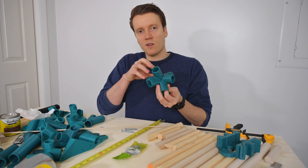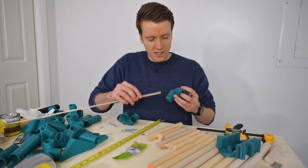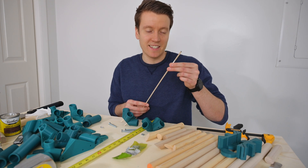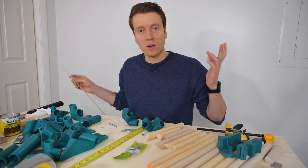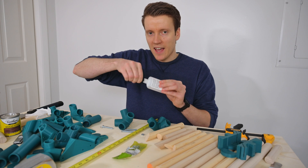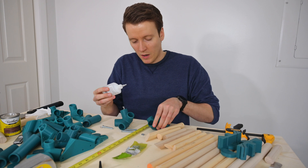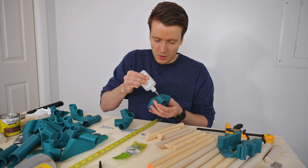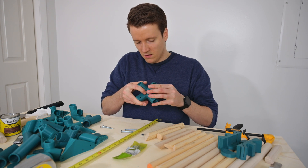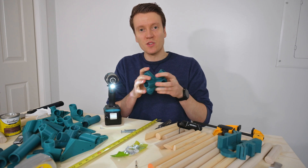That bolt, when you tighten it down, will hold the whole thing together. It is important you make sure you line them up correctly. I'm going to cut a couple dowels using this saw — this dowel specifically is a 3/16 inch dowel, which worked perfectly for me. Now that we have the dowels in there, I'm going to put a little bit of CA glue — basically just some super glue. Wood glue will probably work better, but I'm going to pop just a dot in there, not very much at all, pop this in here, and then thread your bolt through. Make sure when you're tightening you don't over-tighten.